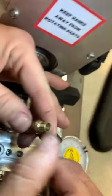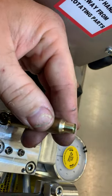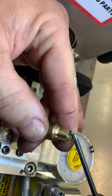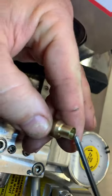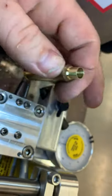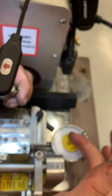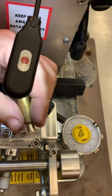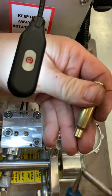I want to point out here — see how it cut good on the outside with full cleanup. But you see this little spot right here — it didn't clean up on the inside. So what we'll do is move that even further counterclockwise and take more cut out of the inside.